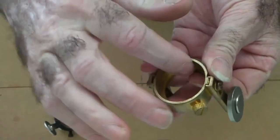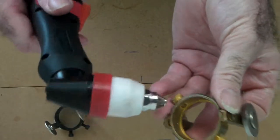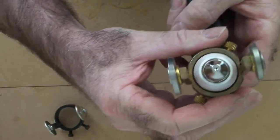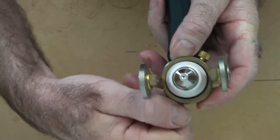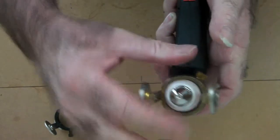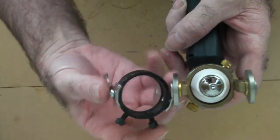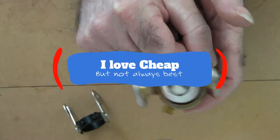It's got a collar in here that actually fits into your P80 torch really, really well — much better fit than the other one. You tighten up the grub screws here and notice this one centers itself, whereas the other one was a bit off to one side. On the cheap one the two grub screws are on the same side and it pulls the guide off-center because they're disposable and cheap.